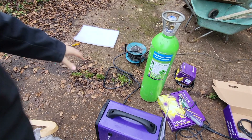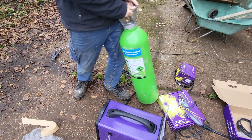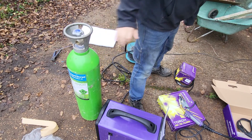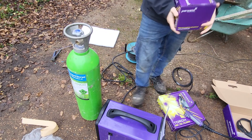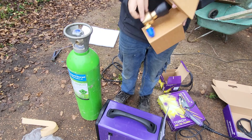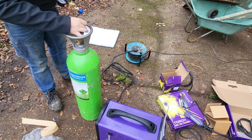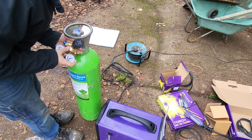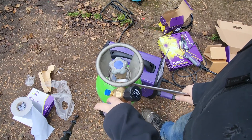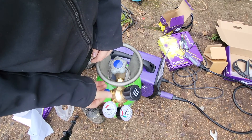The last thing you need to set up is to attach the gas. Here's my bottle - it's twice the size of what I thought it was going to be unfortunately. Should have ordered a 10 litre, not a 20 litre, but oh well. We've got a regulator - should be in here - yeah, gas regulator. Get a big spanner on there. Okay, that's tight. So this one's going to be our output line to the welder.